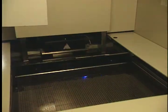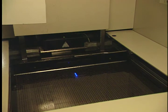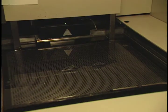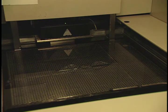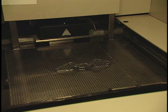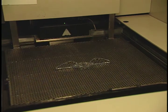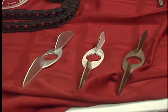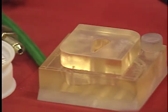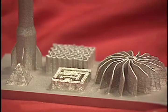It's a very simple process. What we can do is we can scan it with a 3D scanner. After the 3D scanning recognition, what we can do is we can prototype it out of plastics, which comes out of a 3D plastic machine. And then from that point, we can fit the fitment and make sure it's the right proper fit for the vehicle. And then from that point, we can build one out of metal through a rapid prototyping system. What it does is it can produce a part, building it in layers of plastic and being cured either by UV rays or by laser.